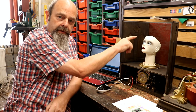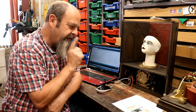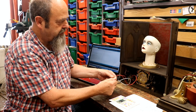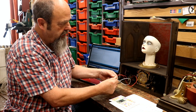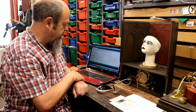It's another day, and I now need to sort out the positions of all the servo motors, max and min positions. Umming and ahhing about it, thinking, how can I do that? And then found the one pin on the Teensy that's still free can be used as an analogue input pin. It's fantastic. So, with the aid of a potentiometer, I can now see her eyes moving. So I'm going to go through each servo motor and just work out the max and minimum, because I don't want to put any stress or strain on the servo mechanisms inside.